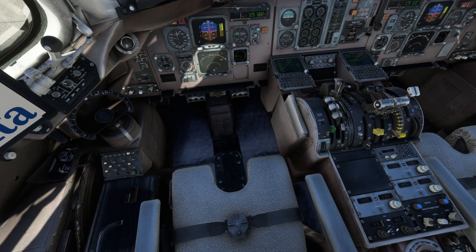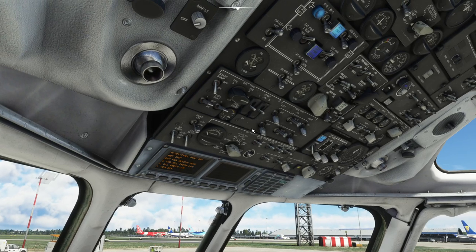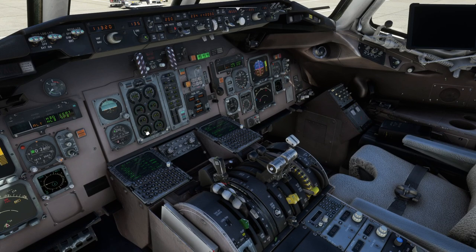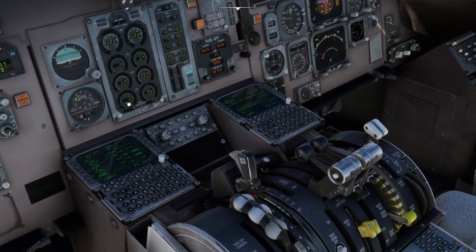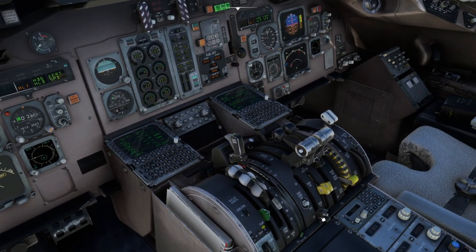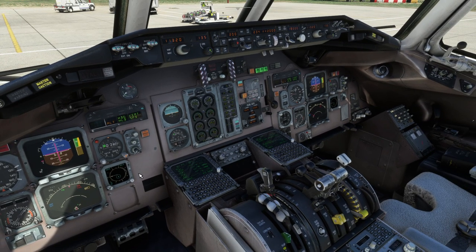Okay. So engine number 2 should be stable now, and it is. So we can flick that back shut. We can roll down the starter for engine number 1. You'll see the N2 number start to increase. So that's the gas turbine being spun up by compressed air from the APU. When it gets to 20%, we will advance the starter for engine number 1 and get the engine up and running. So advance the starter. Exhaust gas temperature rises, the turbofan starts to speed up, and we're almost there. So we just wait for that to happen.